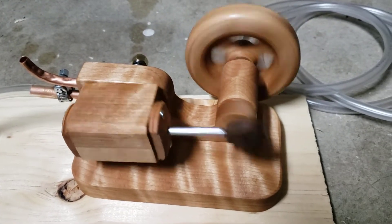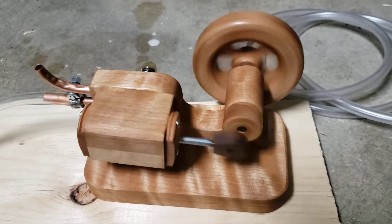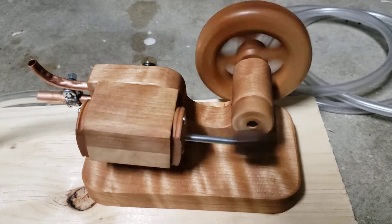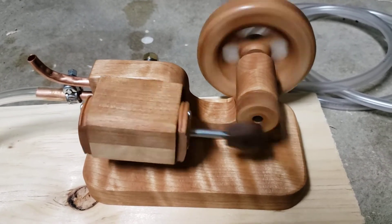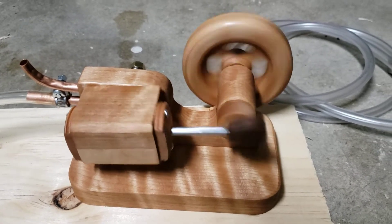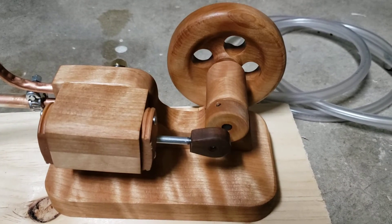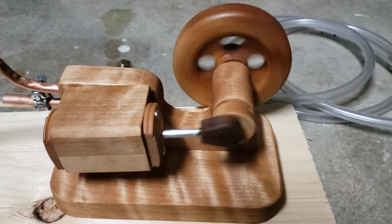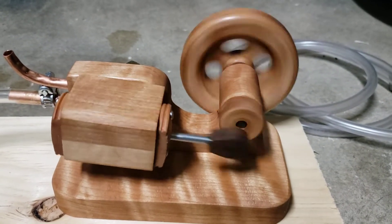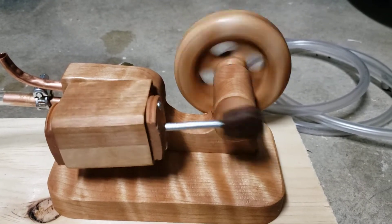What you're seeing here is as the air pressure in the tank lowers, the regulator is being pressed down less, so it's letting more air through. As it tries to resist the air pressure from the tank a little bit, the air pressure it lets through is a little higher, so I'm going to lower it a little more. And it'll be stalled — but it starts right back up again. It's a nice little engine, just sitting there rotating its crankshaft.